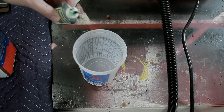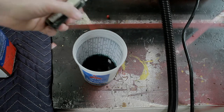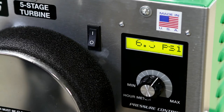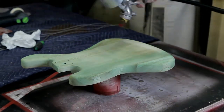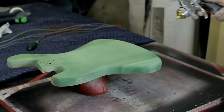This is denatured alcohol. I'm squirting in some trans-tint green, then putting it straight into the spray gun — the Precision 5 turbine. I sprayed it on very lightly, running about six and a half PSI with the gun turned down as low as it would go to get a very light, even coat on the guitar body.